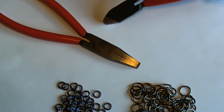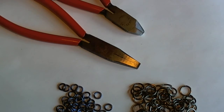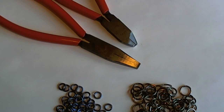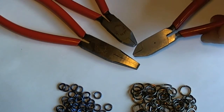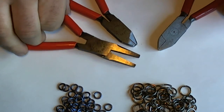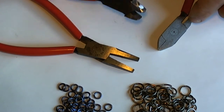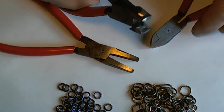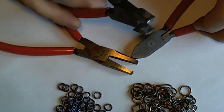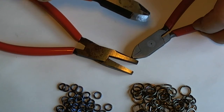And what we do — you can see the before and after — we cut off a little over half of the nose, and we grind a little bit of the teeth out and make the inside of the plier smooth, and then just reshape the tip.